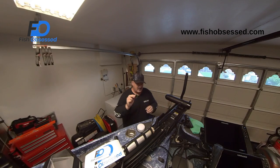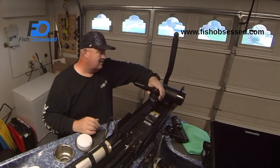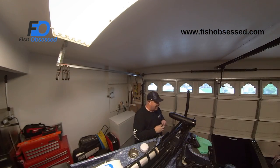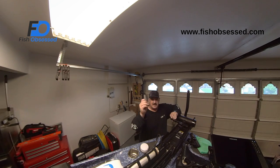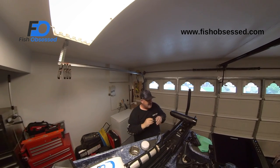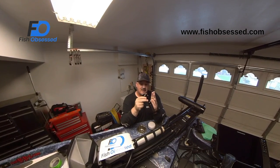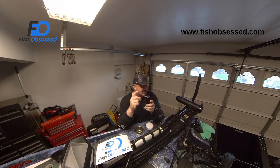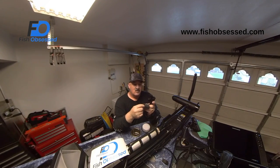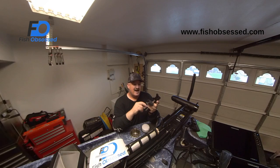So we've got the little grippy pads. Now it comes down to this bracket — put it up right where I want it. Bracket goes here, but you've got your plastic gasket. This helps with the compression and tightness so you don't have to go super crazy. I just talked to the owner over there at Fish Obsessed — this is a high-grade, dialed-in plastic. There are two types of plastic, and the biggest thing with the way this is put together: do not use Loctite. You don't want to use any type of Loctite, especially on the transducer mount. It does not work well with this type of high-end plastic.